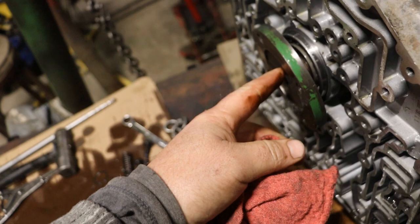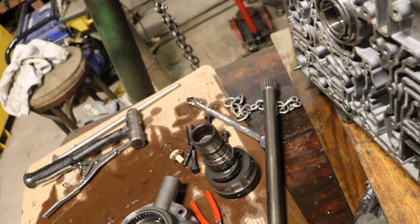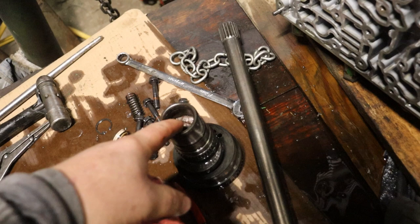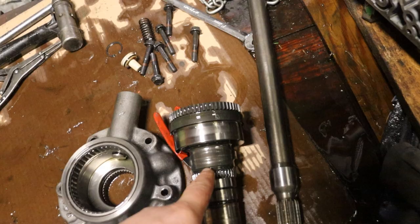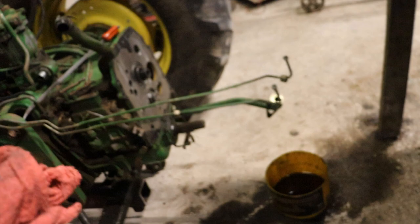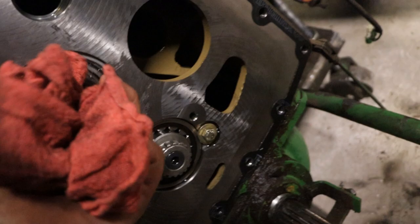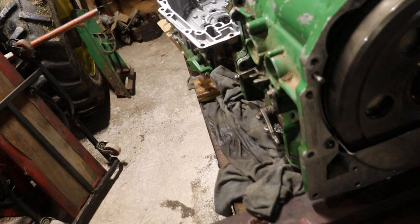Here's the broken shaft and the hub that would sit there, and then your shaft from your flywheel hooks to this. We couldn't pull it out with magnets — that's why we had to split the tractor to get this piece out. But since it's so welded in there, we might just have to get a new shaft. The pump and everything looks really good. We inspected the gearbox — no suspicions in either gearbox, everything rolls like it's supposed to. Same on here — we put the input shaft in and you can hear everything, see some gears in there, and everything feels really good and normal.